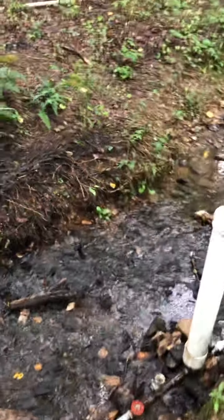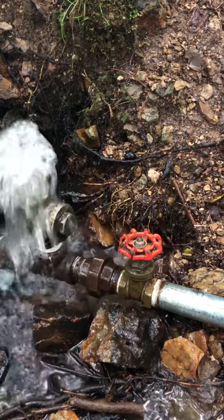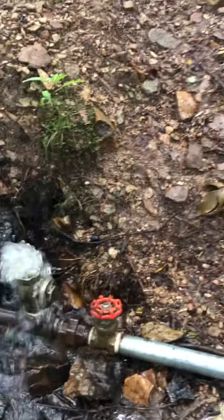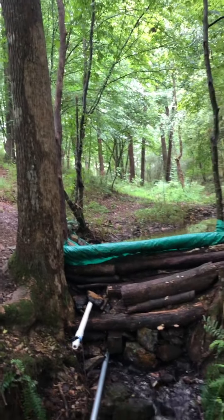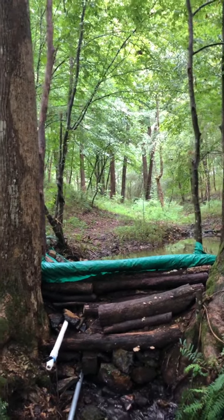And what I'm also seeing, if you remember in my last video, I calculated about 280 to 300 pounds of pressure hits these valves when it closes. And over time, you can see that knob bouncing now. The brass is worn out, and it is cutting a little bit of my flow right now. So after a year, the first video I said I was getting a gallon every 2 minutes and 15 seconds. Right before the drought made the pump unreliable, when the water was still low but the pump ran constantly, I was getting a gallon in 4 minutes.